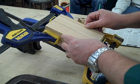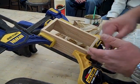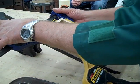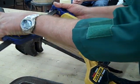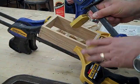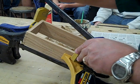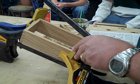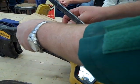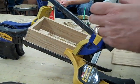You could take a tape measure and go from corner to corner, but you're going to need a diagonal clamp to pull it into square. When I say diagonal clamp — if I was going to clamp this to pull it in square, which it's out a little bit right now, I just go like that and that pulls it right into square. So you could glue it up like that — sure you could.